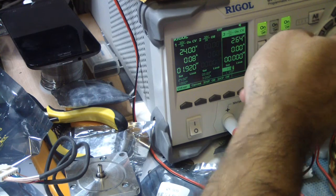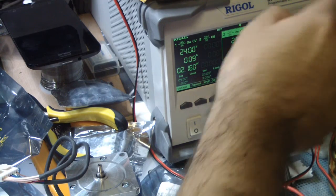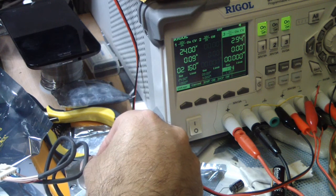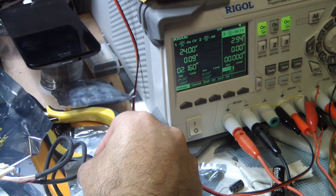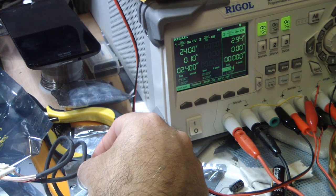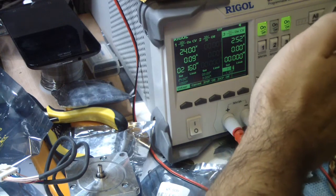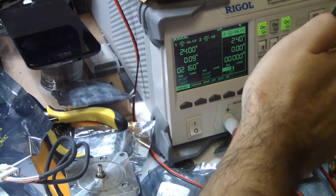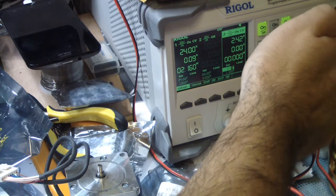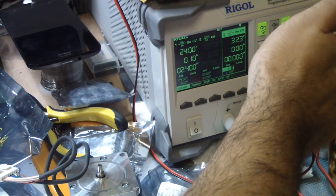At .6 volt it stops. Okay, about 2.7, and now it is anti-clockwise. So if I am above 2.7, it is anti-clockwise, and if I'm below 2.7, it is clockwise. So it is not as written in the document either. Okay, but I'm used to it.